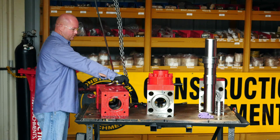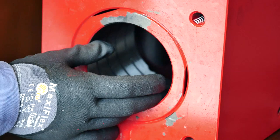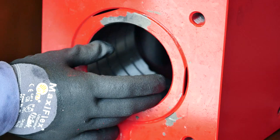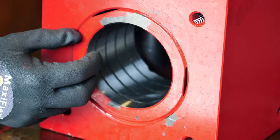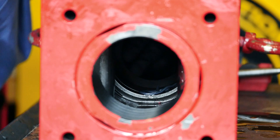This bushing has wear tolerances depending on the size and model, and if the bushing is worn too much it can cause a piston problem later on down the road. Also check the round bushing up inside the front head and make sure there is no damage to it. Also inspect the chisel pins and the stopper pins that retain the tool in the front head.